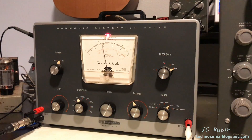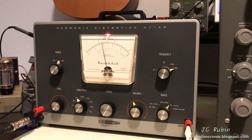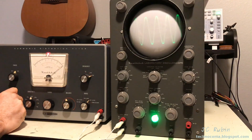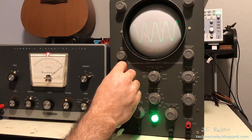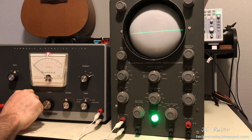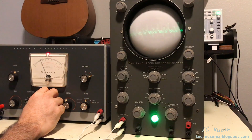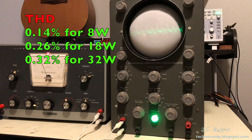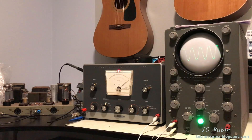With the resistor sufficiently cooled, I'll do one more test at 12 watts — this will be kind of the middle of the road for this amplifier's power production, and I should get some time out of this resistor before it heats up again. We are seeing about 0.26% total harmonic distortion at this voltage. So that's it — that's my demonstration of harmonic distortion measurement using all old school tube equipment and Heathkit measuring equipment from the 1960s. I hope you enjoyed this demonstration. Thanks for watching.